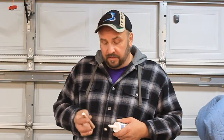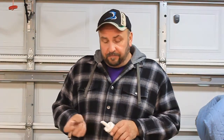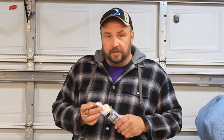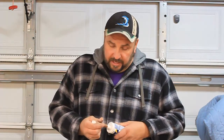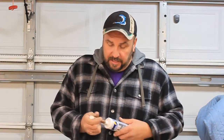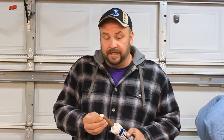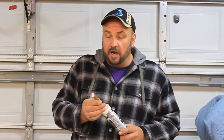I'm going to show you how to make this tube extension out of a piece of copper pipe. What you might use this for is if you're caulking your windows to brick or you've got some aluminum siding. The tube may not be wide enough on your tube of caulk, so we'll make a tube extension and you'll squeeze it right on here. Now it's longer and you have a much wider tip to do your caulking.